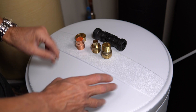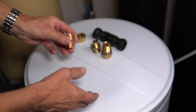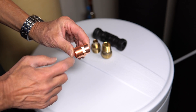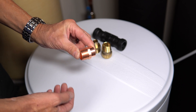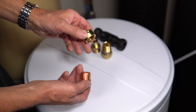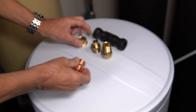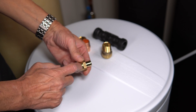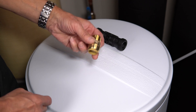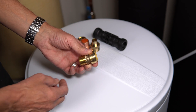Let's talk about fittings. The fittings you purchase depend on what type of plumbing you have and where you're installing the hardware. In our case, we've got three-quarter inch copper, so we're using a three-quarter inch to three-quarter inch threaded fitting. Any fitting you purchase has to go to three-quarter inch male thread because it threads into the fitting that comes with the hardware. If you've got three-quarter inch PEX, get three-quarter inch PEX to three-quarter inch threaded. Half-inch PEX goes to three-quarter inch threaded as well. You can also use quick-connect fittings.